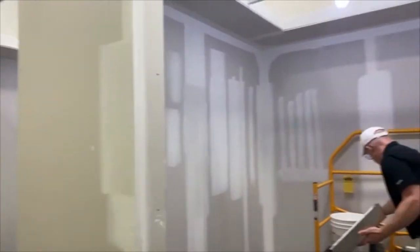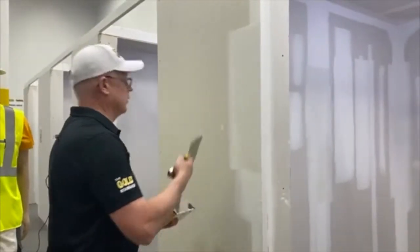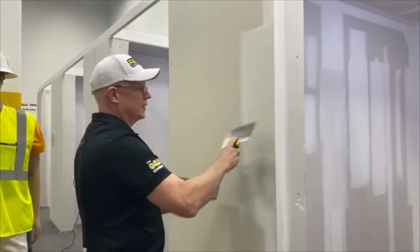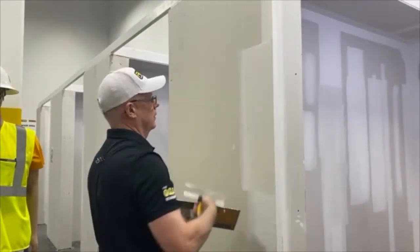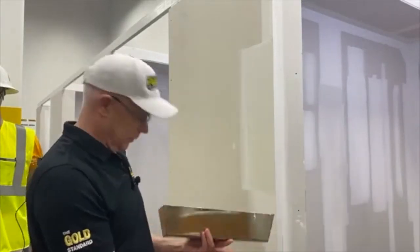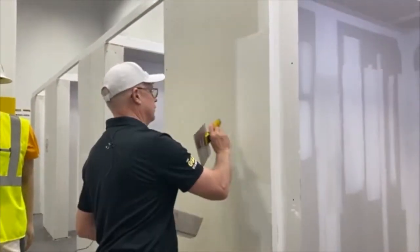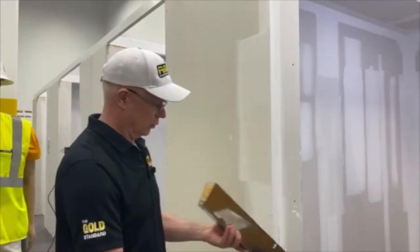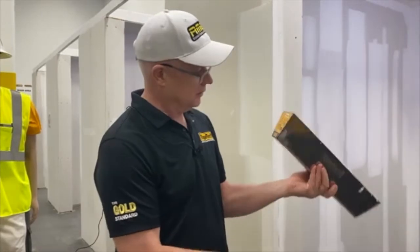I'm going to use the one that I peeled the sticker off of — this is brand new, I haven't really ever used this knife. I'm just putting material on, feathering. It just feels smooth right from the start when you feather. Really, really nice blade for stainless steel. You guys who like stainless steel, these are really nice as well. Again, the backer plate's really strong. If you have to tap something in, you have that alloy steel tip on the end — works really well. The grip works real well too. It just feels good to hold. 12 inch pan or 14 — both sizes. Nice knives.